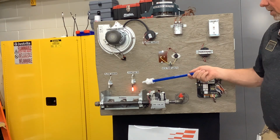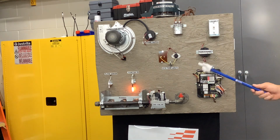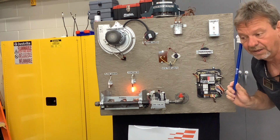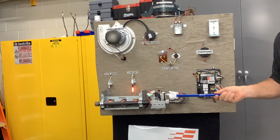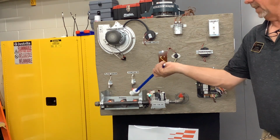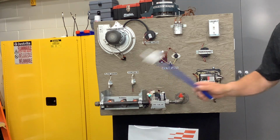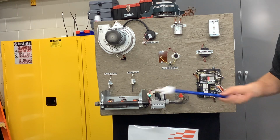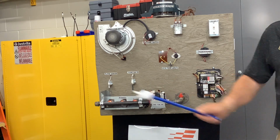Number 3, what is it? Igniter. Igniter glowing cherry red, super hot, right? What's gonna happen next? Gas valve. Gas valve's gonna open, listen. It just opened. It's letting gas through there. So that ignites the gas. We got 3 burners here. So we put lights in there, not spark, but hot surface. So we're simulating that the burners are lit right now with those red lights. See that?